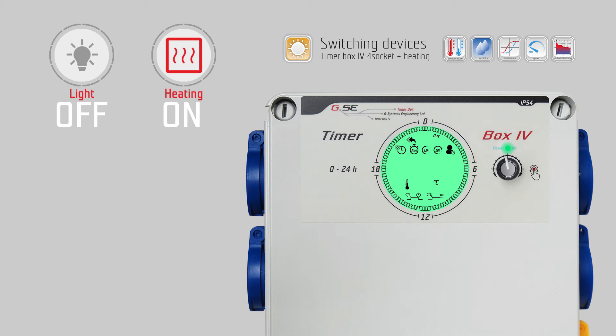To check if the timer is set to manual, go to the main screen and check if the permanent on/off icon is visible. To turn the timer back to automatic, enter the settings menu and set a cycle: 12 hours, 18 hours, or user cycle. For example, we select the 12-hour cycle and push the encoder to set. 48 full segments will appear starting from 8 o'clock, which is the start on time you have entered before.